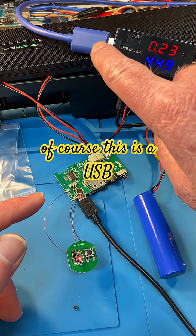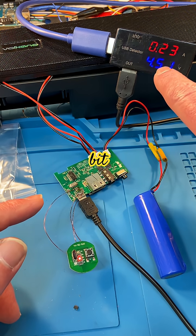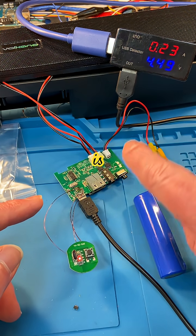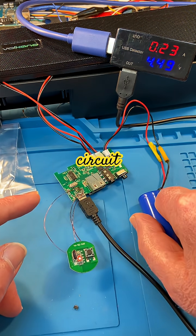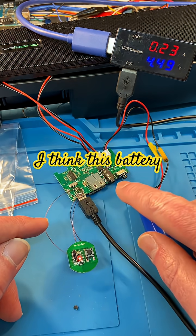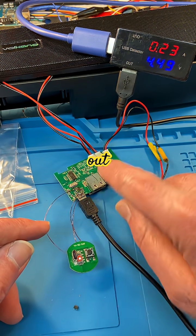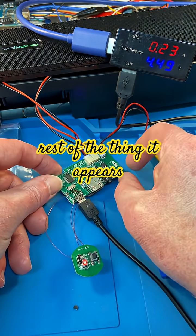As you can see, it's now got it charging. This is a USB extender cable so the five volts is sitting down a bit, but when we get five volts on there it charges at about half an amp, which is surprisingly high for this charge control circuit. Anyway, what had happened is I think the battery went faulty and that charge control chip burnt out.